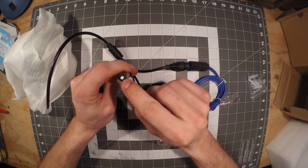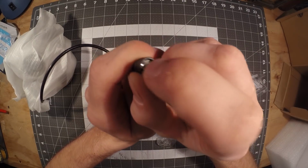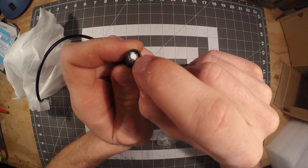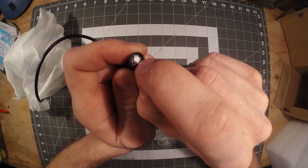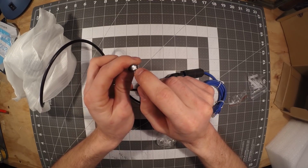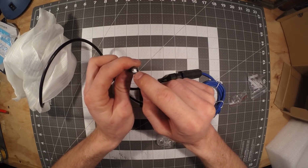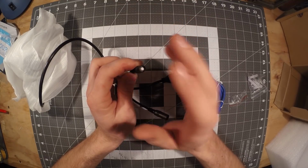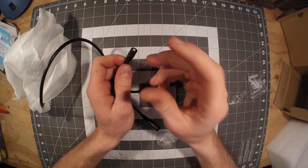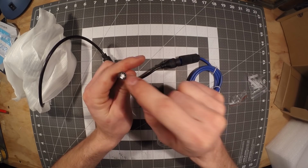So the other thing is this reset button. This reset button is just a regular standard little tactile dome switch. It's potted into this connector here, but the water can still get in between the plastic and inside the button there. And again, that's the same problem, where if this shorted out, your camera could constantly be resetting itself, and you have no idea why that camera will come on when you power it up and then it will never initialize itself onto the network. It'll always just keep on resetting, and you might look at the network switch, and you'll see the networking light will go on and then it'll go out, and it'll go on and it'll go out, and you think, oh, there's a short somewhere. No, it's actually they got water in the button.